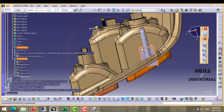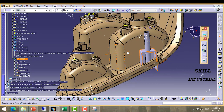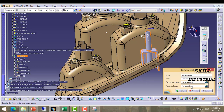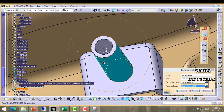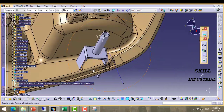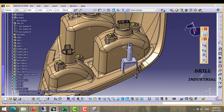Now we want to remove the material below that surface, we want to remove this material. So what we need to do — define this project. Boolean operations: union trim. Faces to keep: this face, this face. Now it looks good — now it becomes one single feature.